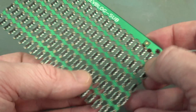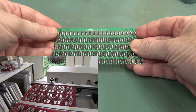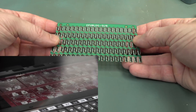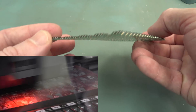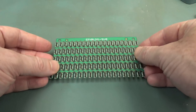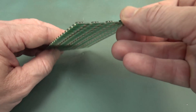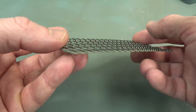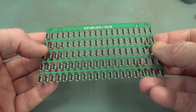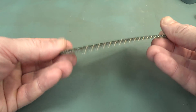The problem is that if you have one big panel like this, stuck in your pick-and-place machine held only by the rails at the top and bottom, when the pick-and-place head comes down to place parts, it's going to warp in the middle. So for boards like this, it's quite common for your assembler to manufacture a custom tray that this board sits snugly inside, fully supported over the entire area. Your manufacturer will advise on that sort of stuff and often just handle it for you — you just say 'assemble my panel, please,' and as part of the tooling charge they'll manufacture a holder for this particular board.